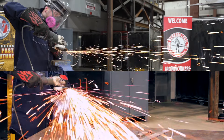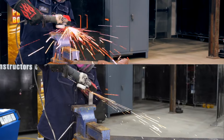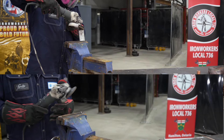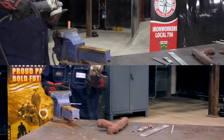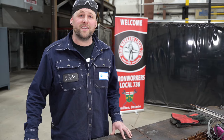Notice that the 7018 and the mild steel have the same characteristics. Notice that the 308L and the stainless steel have the same characteristics. Notice that the aluminum filler rod has the same characteristics as the aluminum bar. Notice that the high nickel barium free electrode has the same characteristics as the manifold. At first glance these materials look similar, but by doing the spark test we noticed that they did not match at all. You can see how the spark test is a quick and easy way to determine what filler material you're going to use to weld or repair. Thanks for watching Efficient and Proficient with me, Kevin Roy.